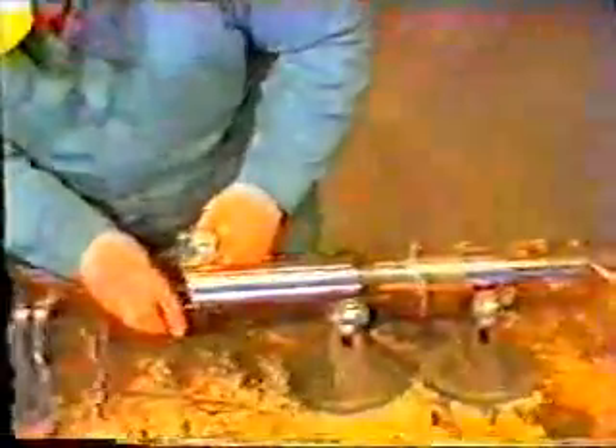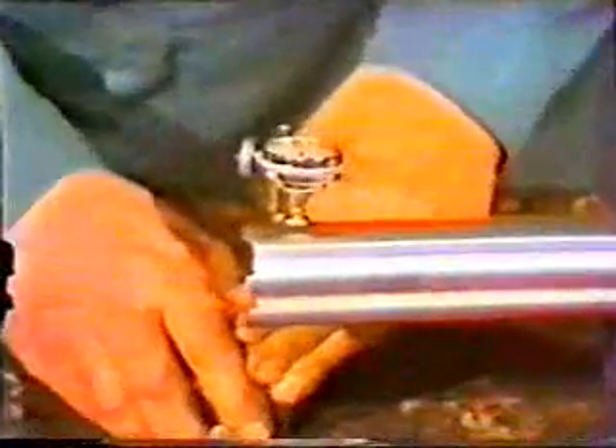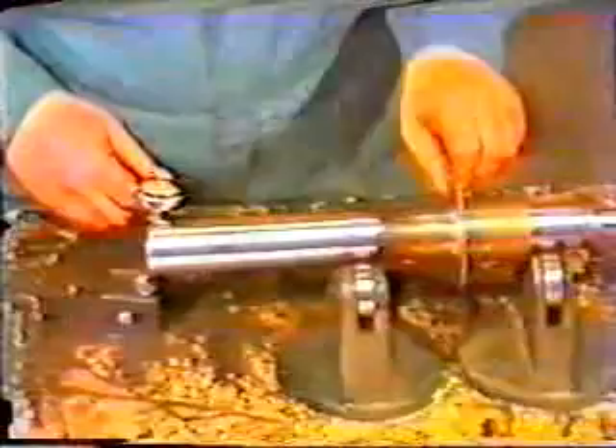Let's rejoin the workman as he checks to see if the shaft is straight. With the seat measurements complete and the blocks repositioned, he's ready to perform the shaft runout using a dial indicator with a magnetic base, which holds it firmly in place. With the indicator tip resting lightly on the shaft, the workman aligns the indicator needle with zero. Then he rotates the shaft one full turn, noting any deflection of the indicator needle and recording the amount to compare to manufacturer's specifications. The indicator is then moved to a second location where another reading is taken, aligning the needle with zero before rotating the shaft.